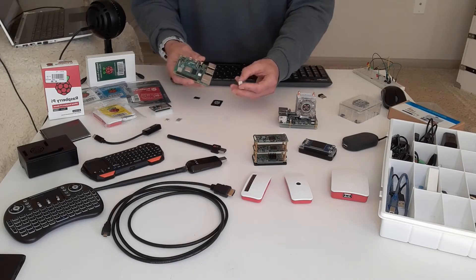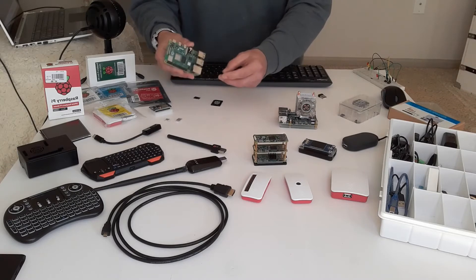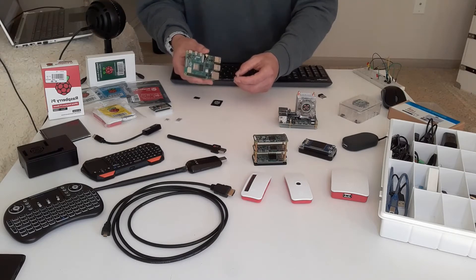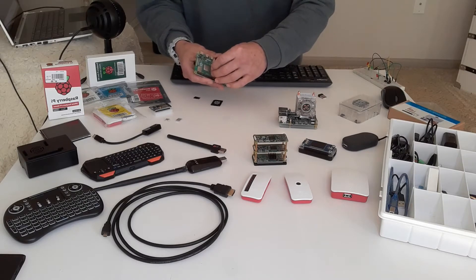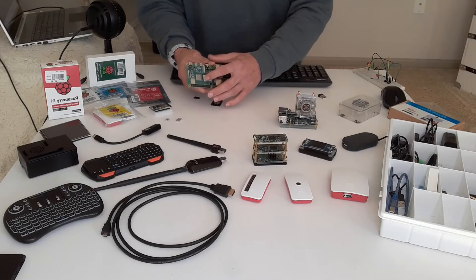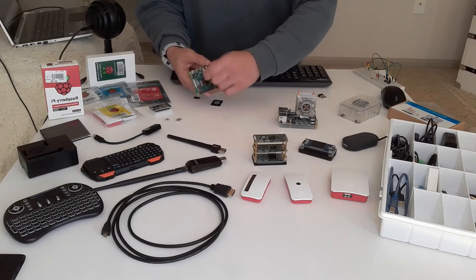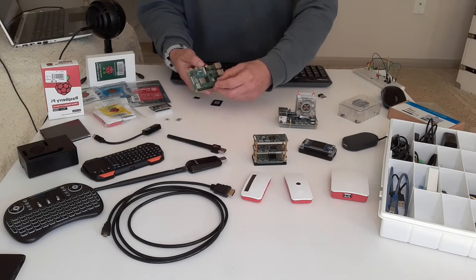A little tip for you guys — I've had to do a lot of things with my Raspberry Pis, and though you may think you're going to be using it for one thing, down the road you may end up using it for something completely different. If that's the case, you may have to take your heat sinks off. So make sure you do use heat sinks, but don't smash them on there. Just set them on lightly so they do their job and the adhesive sticks — but don't push hard into them, because if you eventually have to pull them off, you don't want to be doing a lot of twisting and turning and risk messing something up over a 25-cent heat sink.